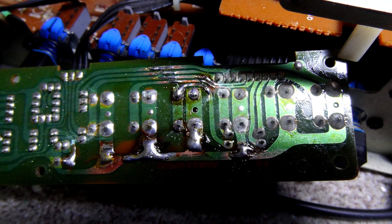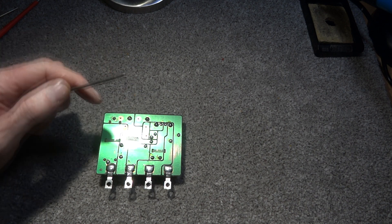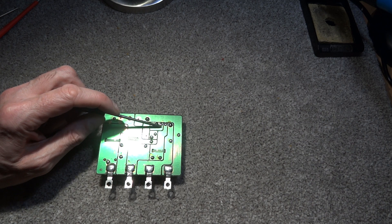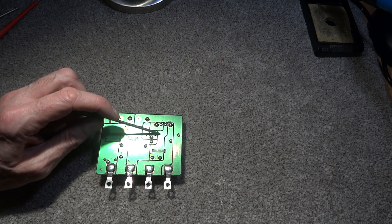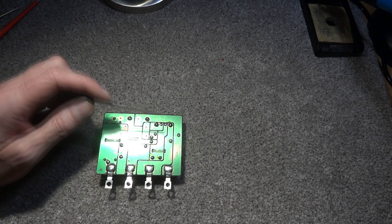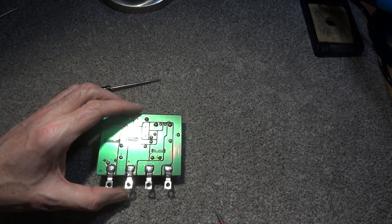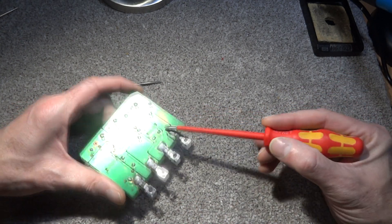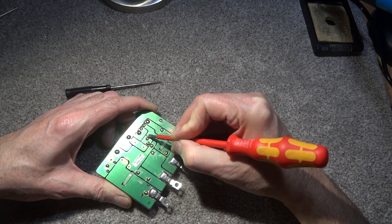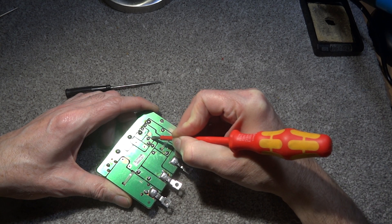Hopefully I've got enough light from different angles so my hand doesn't get in the way like it did before. I'm going to pretend this gap here is a break in the track — imagine the track goes straight across to this solder joint and there's a break there. What we're going to do is scrape off the green protective solder mask so we can do some soldering. You can use chemicals, sandpaper, or whatever, but I'm going to come in with a screwdriver at this angle.